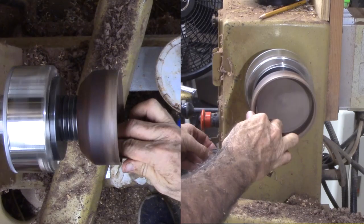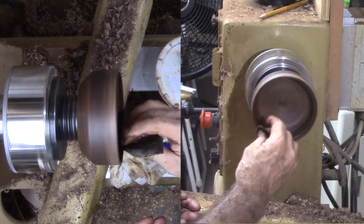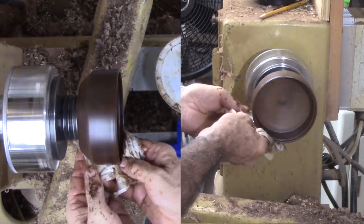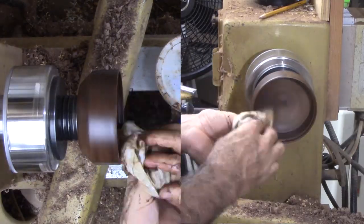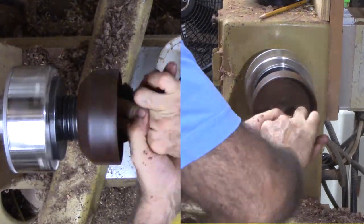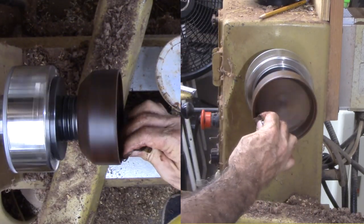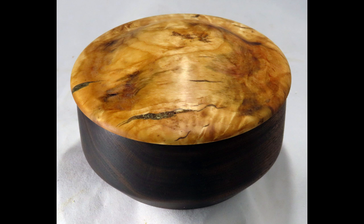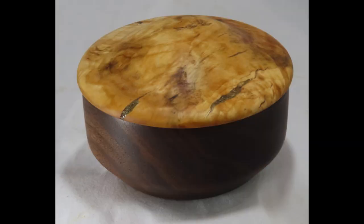Then I sand the bottom with the sanding media. Walnut has open grain — the fine sanding particles in the wax mixture tend to fill the grain. This little box proved to be more of a project than I anticipated. I like the combination of walnut and plum burl — it is much more interesting than a pure walnut box. This box is one that I offer as a remote demonstration via the internet for clubs during the pandemic and beyond, just hopefully without the drama of this particular box. Please give this video a thumbs up, subscribe on my website and tell your friends. I appreciate your comments and questions. Every week I make a new woodturning video and add it to my website.